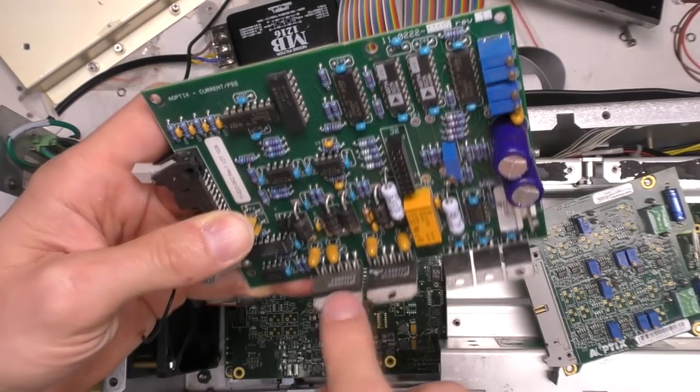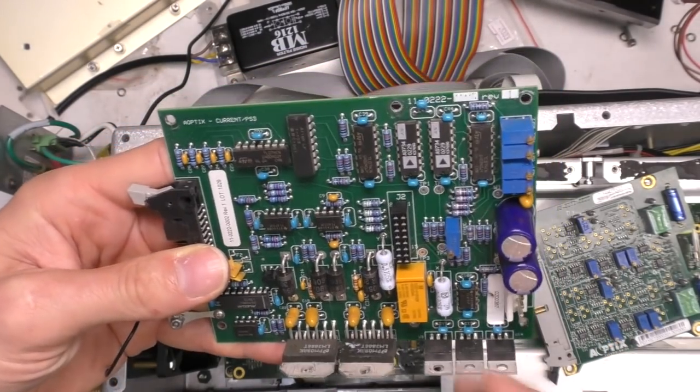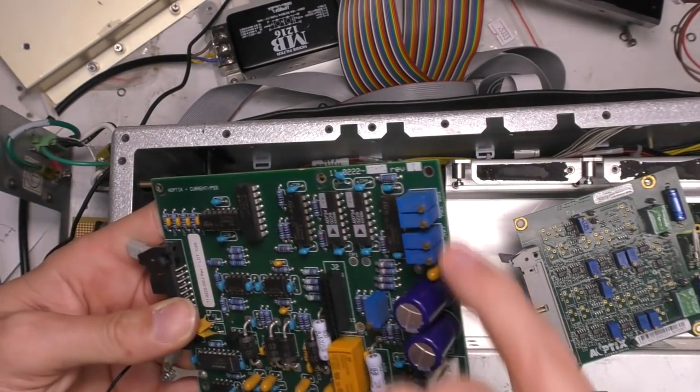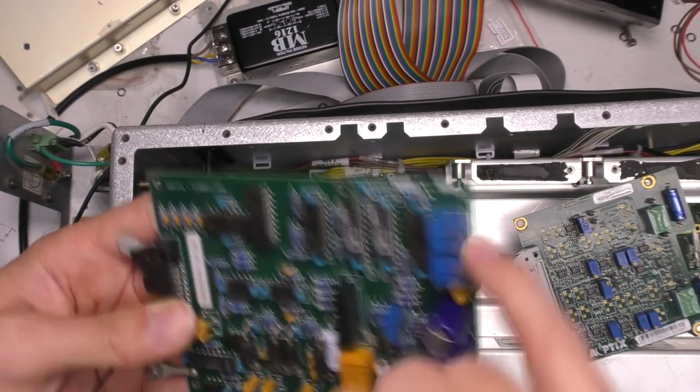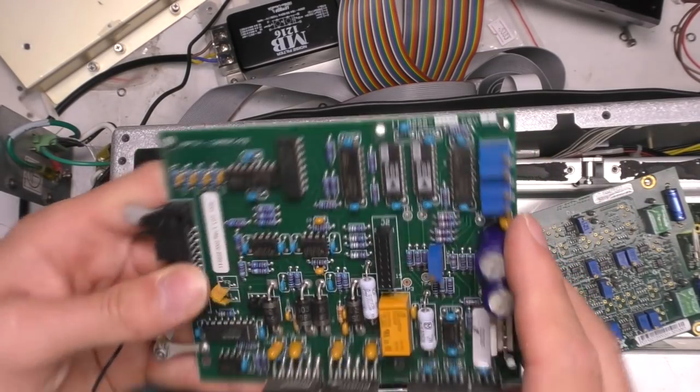and this will be the power driver stage with a couple of stereo audio amplifiers which will be driving the voice coil. There's a couple of analog multipliers here and pots for scale and offset, so this is all basically analog stuff, turning a voltage into a mirror position.